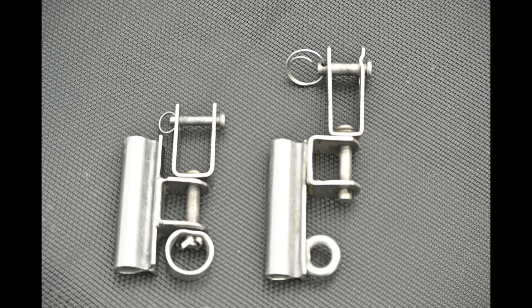To actually pull the sail down, you can either tie off directly to the ring on the bottom of the slide at the gooseneck, or you can put a small block on there which will make it a little easier — you'll get a little mechanical advantage. Either way will work. You're not cinching down with the same force you would on a Hobie-16. The owner's manual says just get the wrinkles out of the sail, basically.